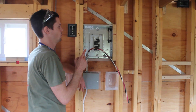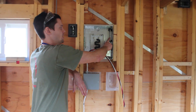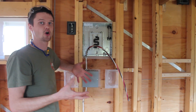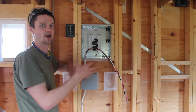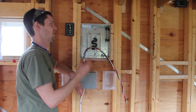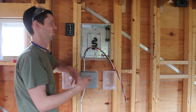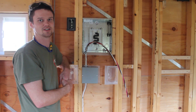So it's important to understand this whole concept and see the big picture to know whether or not you need to have your neutral connected to the system. There may be cases where you would want it connected — for example, if you're totally off-grid and generating your own power, you may be creating that one spot where the neutral does touch the whole grounding system. But now we're talking about all sorts of different situations. Basically, the short version is: if you're not totally confident in what I'm talking about here and how this produces a safe situation, you should definitely consult someone who does understand it.